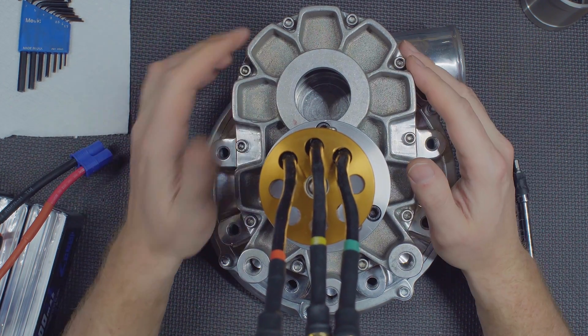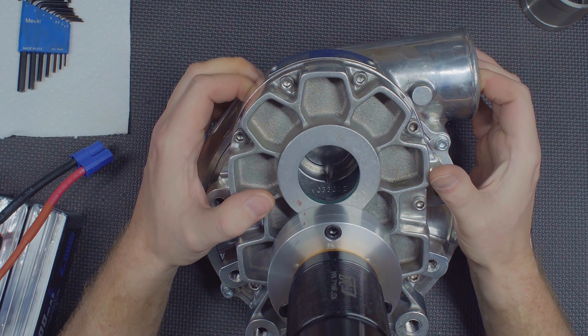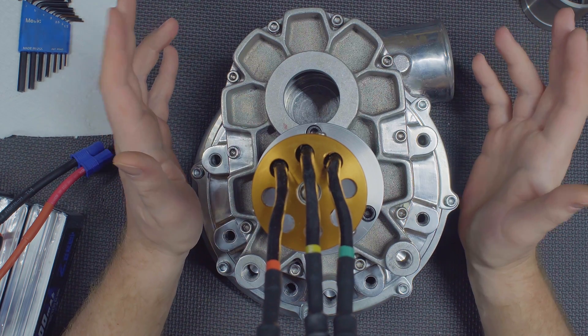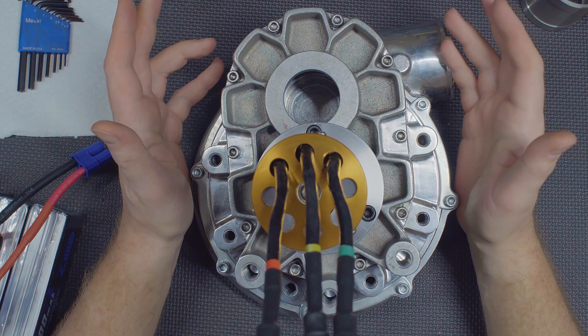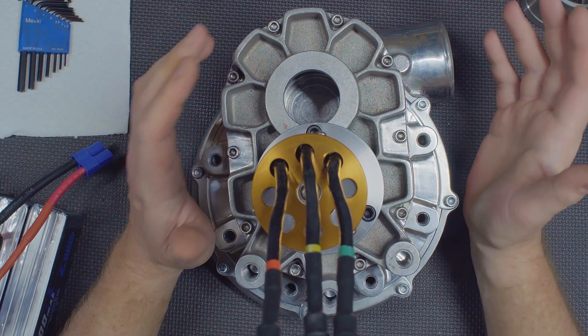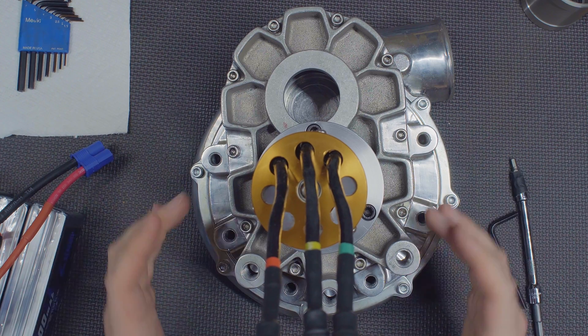What I really wanted to do is take a look at how this thing fared. This is the inspection cover — this is the original input shaft hole, which we don't have anymore. I had a piece of gaffer's tape on it just to keep dust out. You can see the Kluber lubrication Isoflex NBU 15 — I just like saying that — spread out past the Teflon washer. The Teflon washer in the picture is actually the thin one that was sort of concave, so I probably overfilled the bearings. The engineer Steve told me to fill them 30 percent, but that's kind of hard to judge.